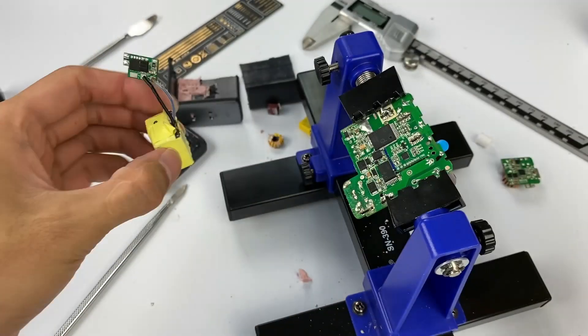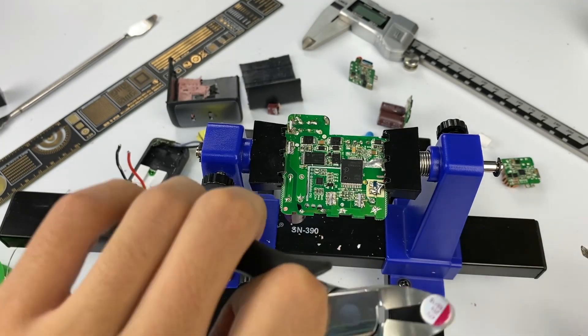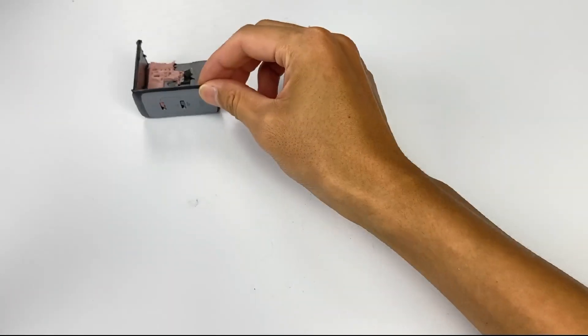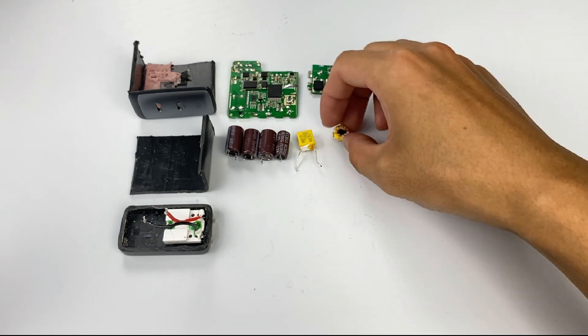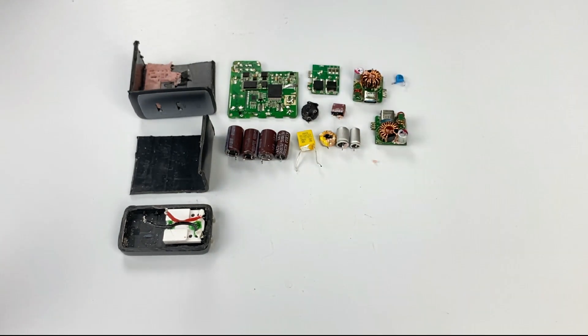That's all for the teardown of the Anker PowerPort 3 2-port 65W charger. It adopts the brand-new design of the Anker PowerPort 3 series and keeps the small size, folding pins, dual USB-C, and multi-port capability. The charger uses a Power Integrations power chip with ACF architecture reaching 95% efficiency, which is the guarantee of its small size. If you want to buy this charger, it will be on Amazon soon — once there's an update I'll put a link in the description. If you want to see other Anker charger comparisons, click the right side to see more. Don't forget to subscribe if you want to see more. I'll catch you guys next time.